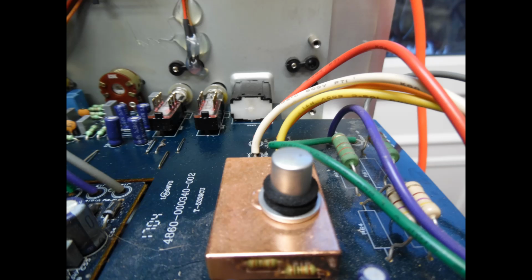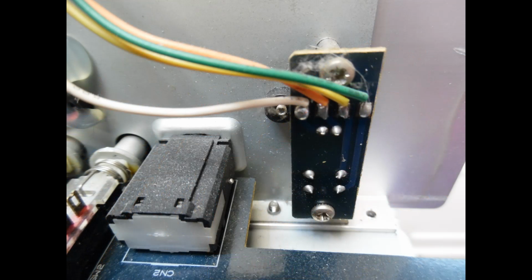Very, very common. Now, let's come back to this other issue which we spoke about, where the customer reported that when they pressed the front standby button, sometimes it would work or they'd get key bounce. The reason for that is that the PCB mounted miniature push buttons just become worn. What I show here is the back of the circuit board, and on there you will have the LED, which you see from the front fascia, and there's also the 4-pin, single pole contact switch, and it just becomes very, very badly worn, and that's what you find.